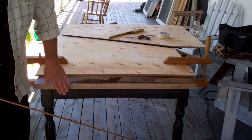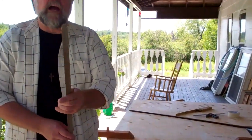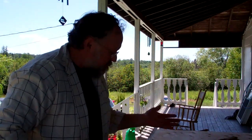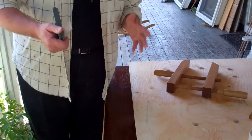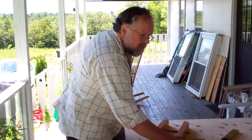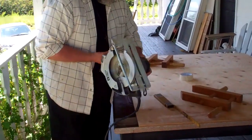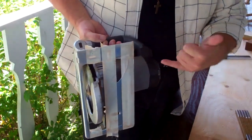Now what I have to do is go all around the table removing that little round strip — that's all the problem. Then we'll put our molding strips in place, fit them, and glue them in the way they ought to be. Now, just a little trick for setting up the straight edge to run the saw against: you have to measure the base of the saw to know how far from the edge of the saw base to the blade. You need that number.